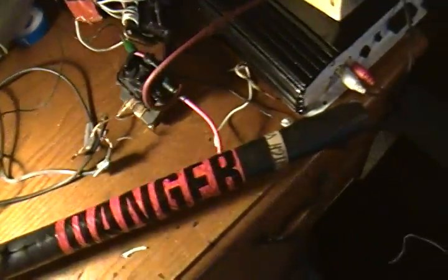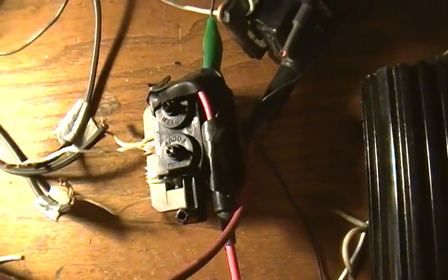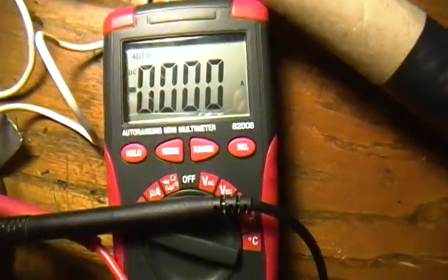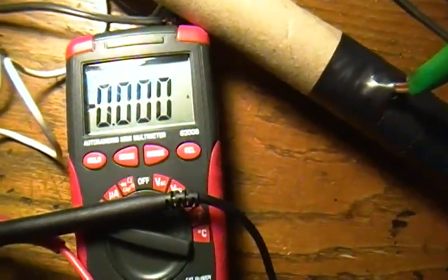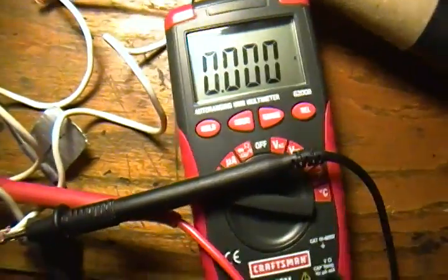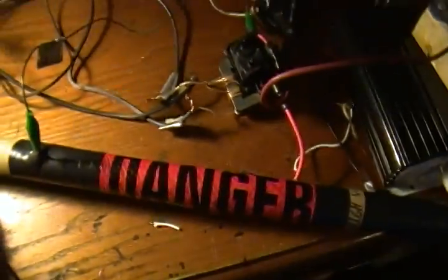So we're gonna do another test on that. First we're gonna do it with this new flyback that I got off eBay. We have a multimeter hooked up — we're gonna measure the current draw on idle and then while we're arcing. Also this little chicken stick I built just for the fun of it. I added a little switch on the variac so let's go show you the arcing from one flyback.